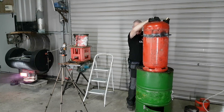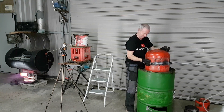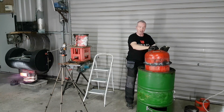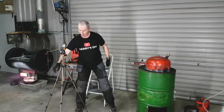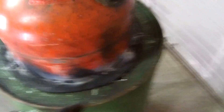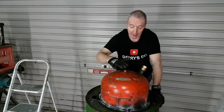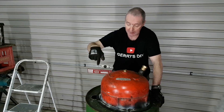The trick is to keep everything intact. Now I can let it drop with this and it can't go through — fingers open, there you go. There are a couple of holes in the top of the oil drum where the filler was, so I've got to do something with that — there's like a vent on the other side too. The propane bottle cannot go any further into the oil drum; it's held up by this little washer or ring I put around it. It also gives me a great surface to put tech screws or bolts through, and if I put some fiberglass gasket or rope under that and pull it down, I'll end up with a perfect seal.